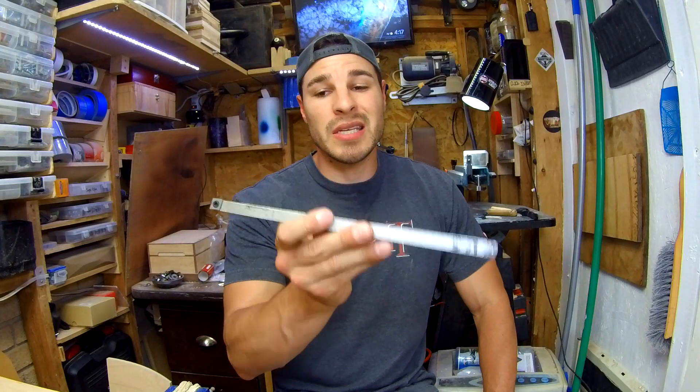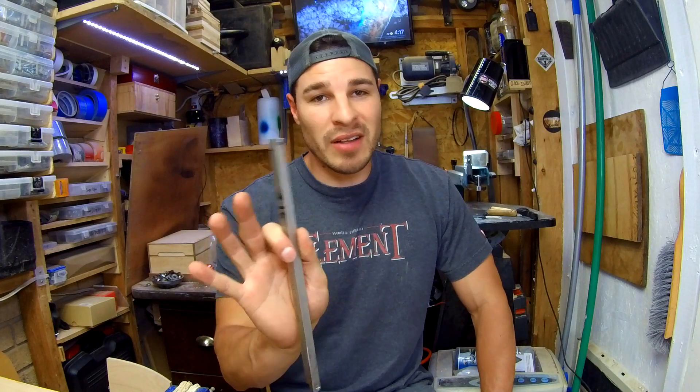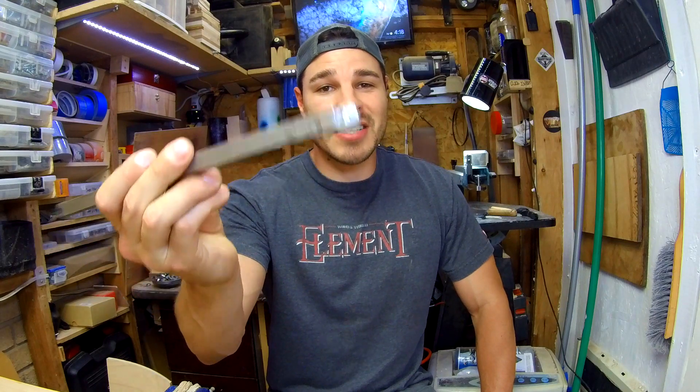Here's the piece we were working on — this is a piece of 316 stainless keystock. This is tough stuff. There is no way I would ever be able to tap this by hand. As you can see in the video, I actually tapped the other side trying to do the same thing by hand — snapped off the tap, had to go buy a new tap — and then I figured I'd give it a shot on the drill press and the drill press worked.